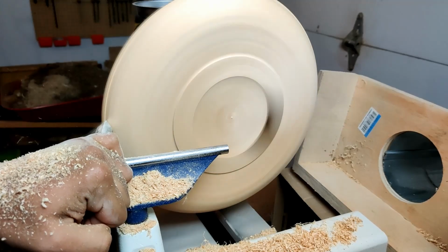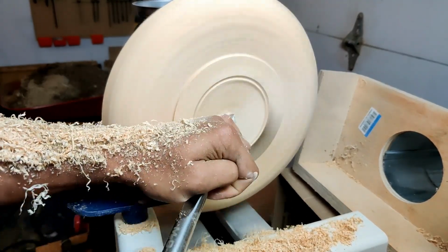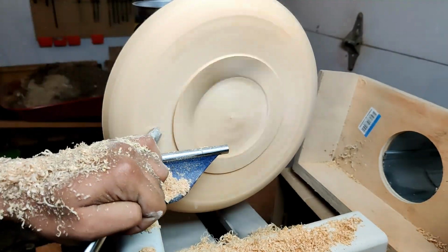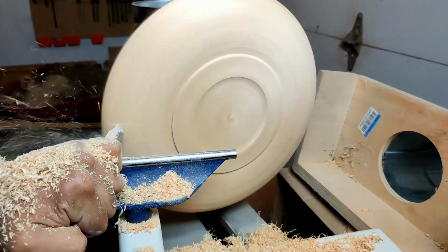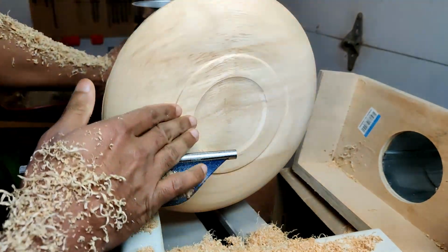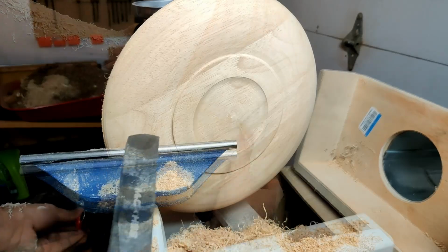As you turn more, you start to get familiar with the sound, the smell, just the feel of the wood you're working with. As I was turning this, I could tell the wood was slightly earthy and it smelled slightly sweet. I think this is oak. I felt the pores and they're very open. The color matches. I'm pretty sure this is oak, white oak to be precise.